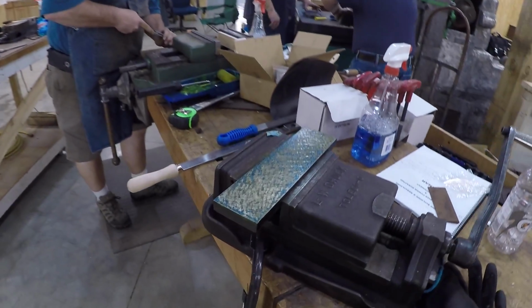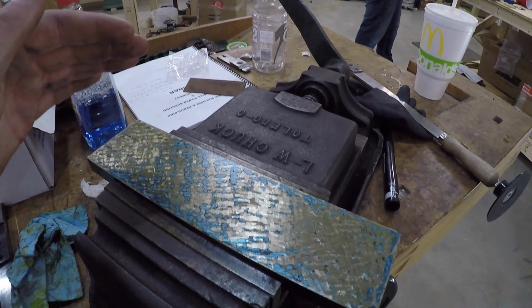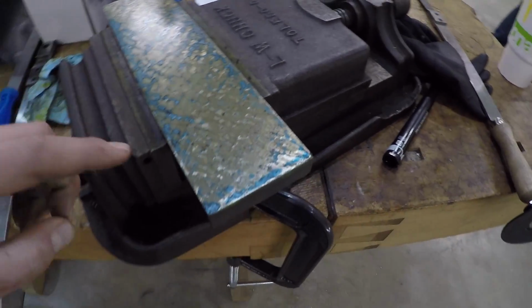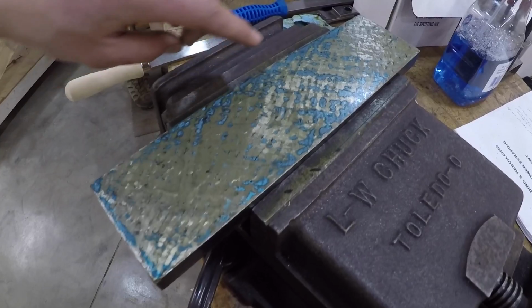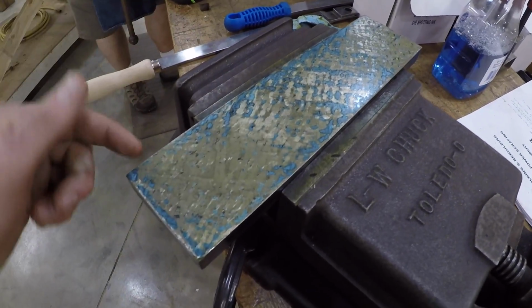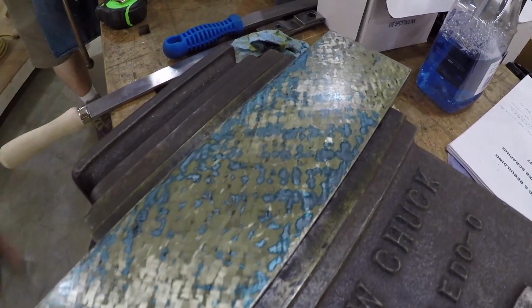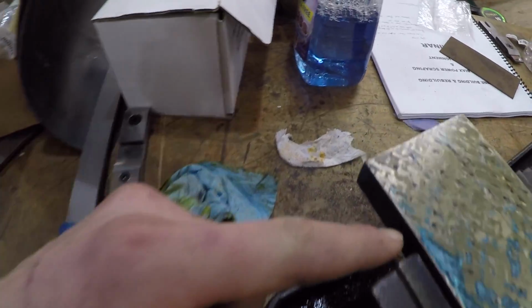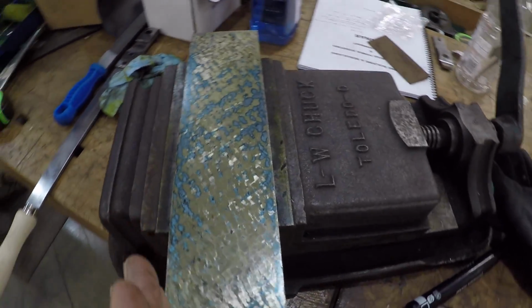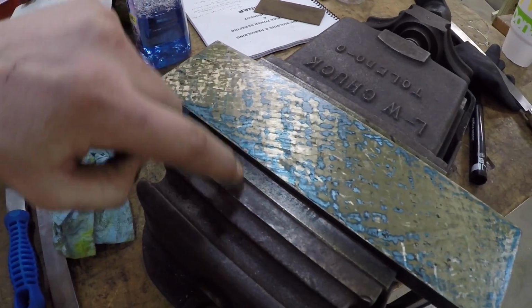This is so cool. So I just took mine off the bluing plate. I've done this a couple times now, and you can see, if I get rid of the glare, where my high spots are. So the more blue across it, the better a job I think I'm doing of starting to get this thing flattened out. Now even this, I couldn't get a half-thousandth feeler gauge under it anywhere. So that kind of tells me I'm doing the right thing. So now what I'll do, I made a note on here about which way. I need to come this way this time, because last time we went the other angle with it. You don't want to get rid of the blue, you just kind of cut marks down through half of it.